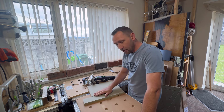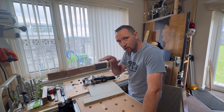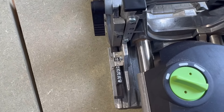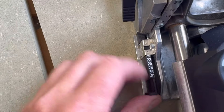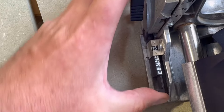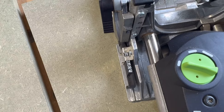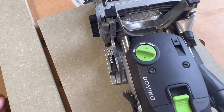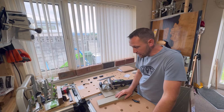The problem we have is that when using the Domino machine we've got to keep an eye on what the face is, because when you cut on 20mm it's not bang on center. I'll do a couple of cuts and show you the difference where it doesn't line up. These are the settings we have - nothing, then 16mm, then 20mm - and that's what's causing one major misalignment problem that puts people off using the machine.